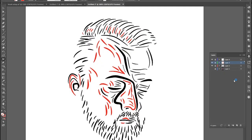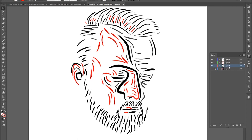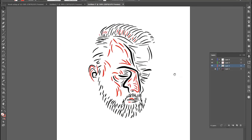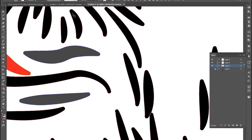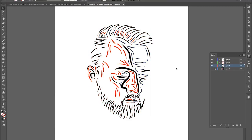I've finished what I wanted to do. I'm really happy with this outcome — you can see the level of detail around the subject and the highlights with the red have really made it pop. Now I need to convert all of these lines to an outline, then save it as a DXF. So I'm going to select them all, go to Object > Path > Outline Stroke — voilà. I've got all the outlines of each stroke, which is exactly what we need for our DXF file to export and import into Fusion 360.